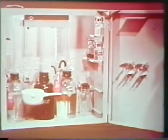The deposit in this boiler tube was caused by solids in the boiler water, a condition caused by seawater contamination. To prevent this, the chloride content of boiler water must never exceed prescribed limits. Therefore, both boiler water and feed water must be tested at specified intervals. In this film, you will perform the chloride test. The procedure is the same for both boiler water and feed water.